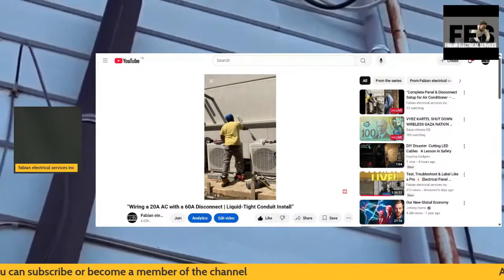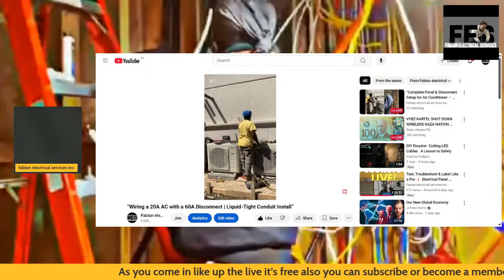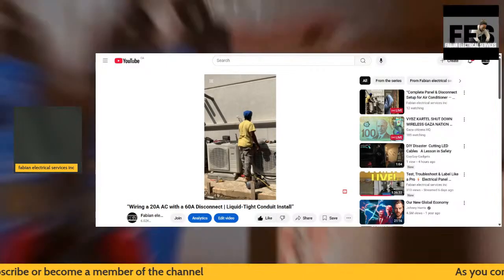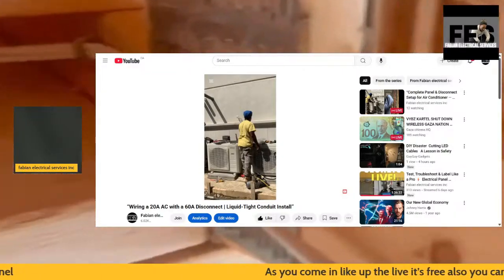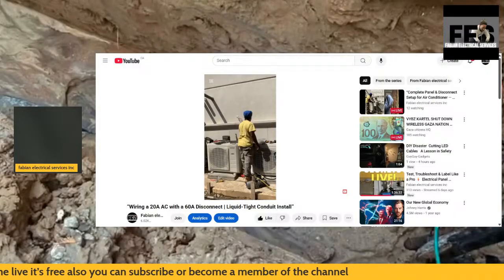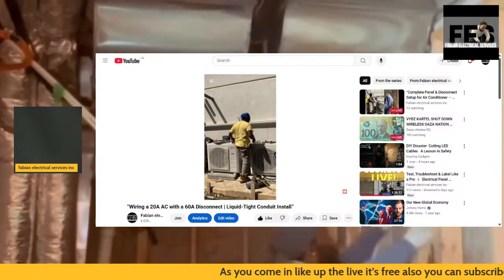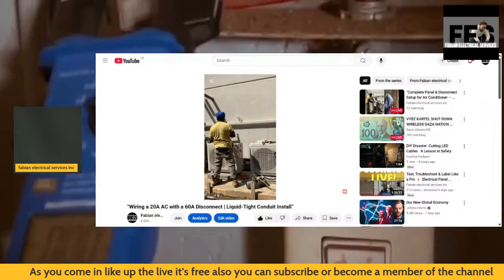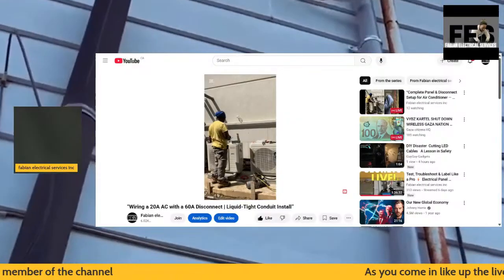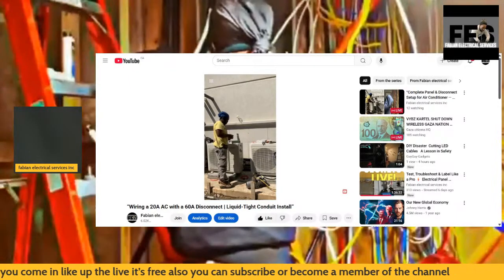So what I'm going to do first and foremost, what I did was I made a little hole with my drill bit, and also I mount my disconnect, which is rated 20 amps, 2 pole. The reason why this is allowed by code is there is a rule in the code book that allows you to oversize your disconnect, as long as you have the proper conduit with the proper wiring going to the disconnect. Now you're allowed to use a 20 amp 2 pole.